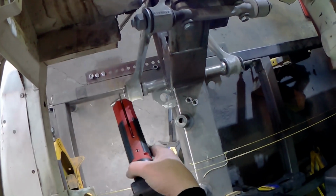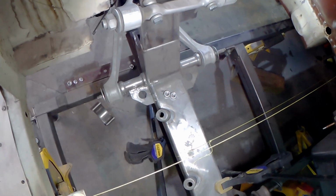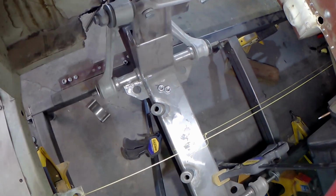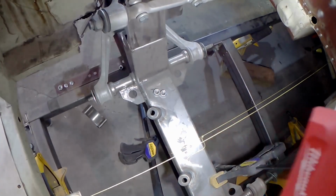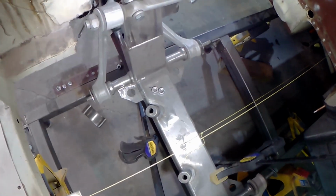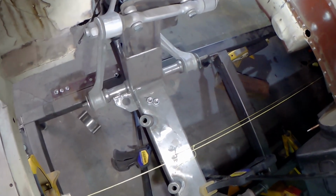Which goes from there, I put that out there, it's about 2 inches long, which is good. This is good. So there's some clever stuff going on here. The idea there is to make sure, even though you see it done wrong a lot, the lower control arm on this particular setup in the original car is meant to be in double shear. Okay, so we have to be able to provide that for it.